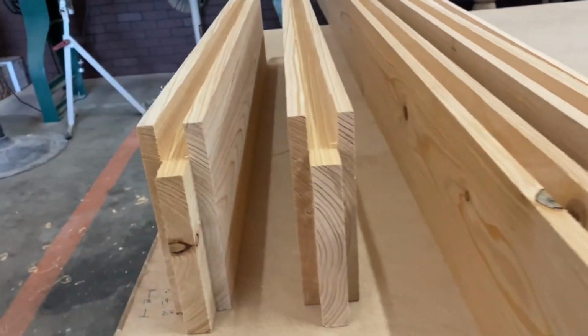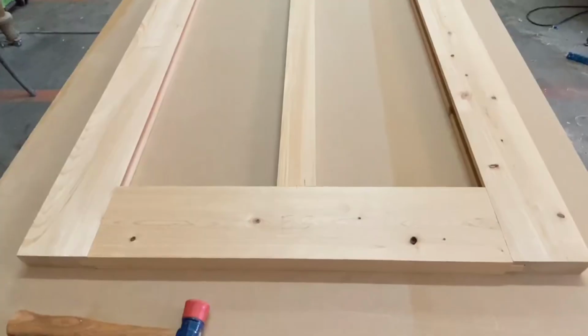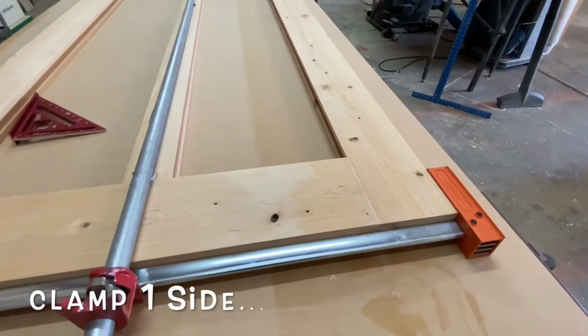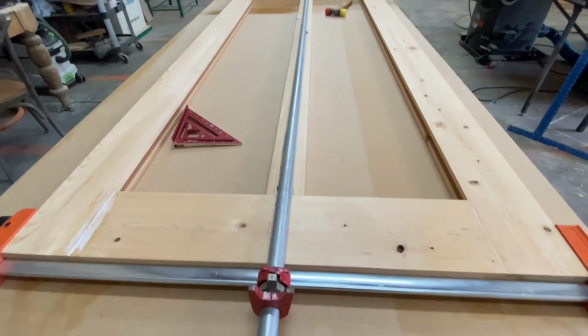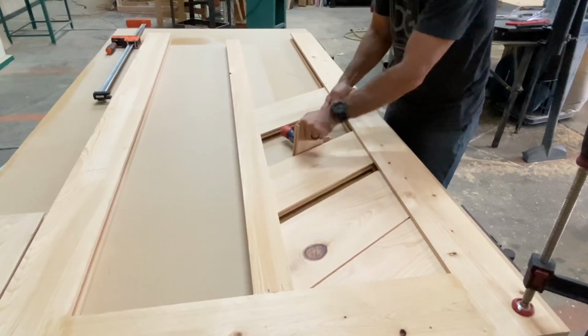My floating panels are gonna make it. I had cut them at 2 feet long, and if I change the degree from the miter 45 to a 22.5, they will make it. Yes! But this project is really stressful and I'm struggling. And although I have a history of building things under pressure, I totally underestimated the time that this project would take. And now I have another issue.